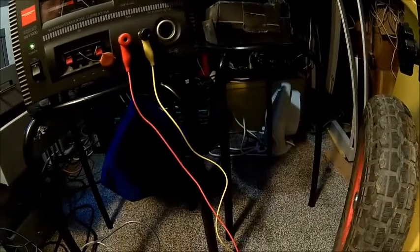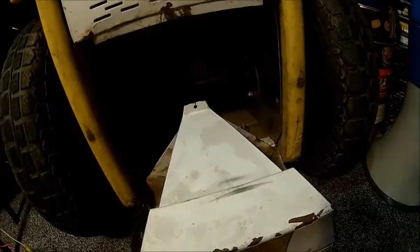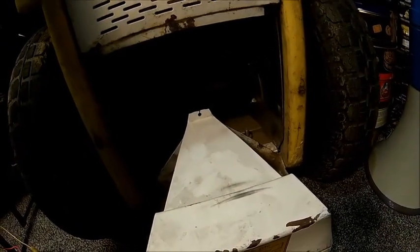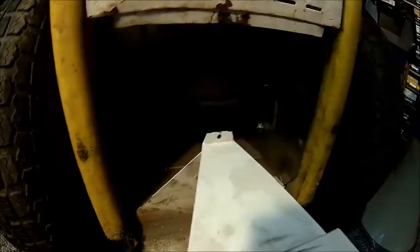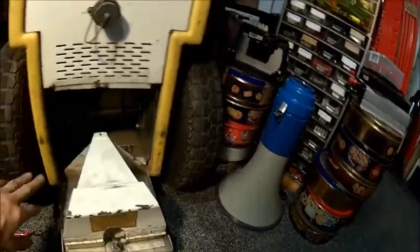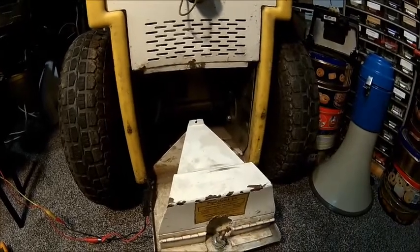We applied 12 volts. It doesn't say anything. We checked the fuse — the fuse is okay. But it doesn't come to life. It looks like the processor is in here somehow. Maybe it needs the antenna to come to life. The question is, how does this thing come apart? Usually there is a simple trick. Because this thing is metal, it makes sense to be shielded. We need to dig a little bit deeper and find out what's wrong here.